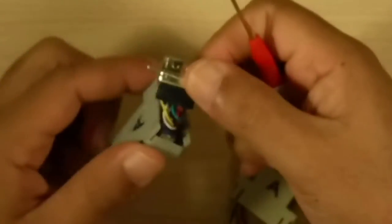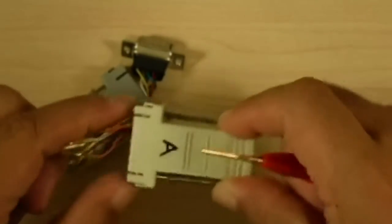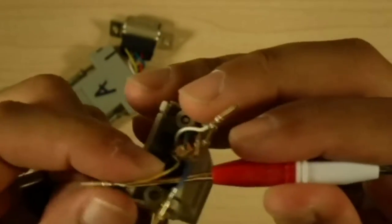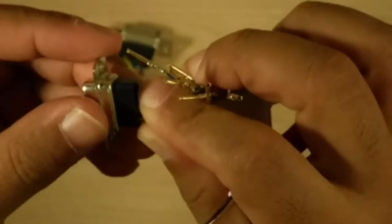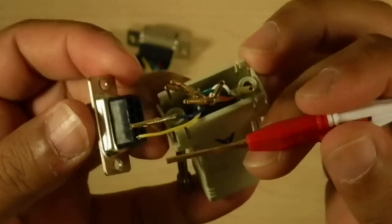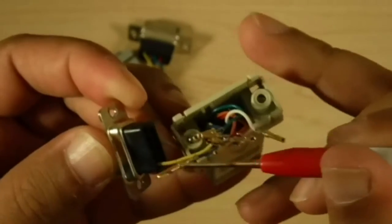If I'm going to change it to the A configuration, the first connector — this pin here — is going to be yellow. I'm actually just going to insert a couple and then not bore you through the rest of them, because this is a very repetitive task. Now that these connectors are outside, it is a lot easier to actually get the wire in. For the most part, you don't actually have to seat the wire in the tool until after you've inserted — you could just push it with your hand. But if you actually wanted to use this side, same thing: there's a channel there, put the wire through the channel, push, and you'll hear it pop as well.